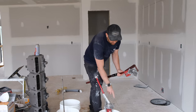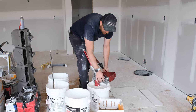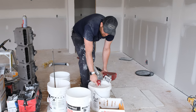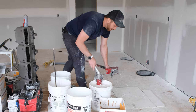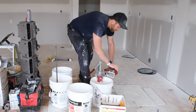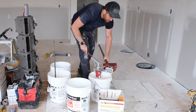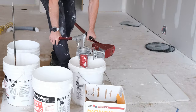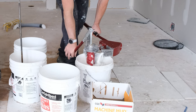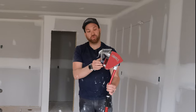We're going to put our nozzle to the pump. I like to angle my corner finisher over the bucket of mud so that if mud comes out the nozzle it falls back into the bucket. Then we just go ahead and start pumping. You can see that back gate is starting to fill up. Mud is coming out the nozzle — if I continue to pump it's just going to keep coming out the front. Now we know we're full: our back gate has hit the little lever and mud is coming out the front of the angle head.